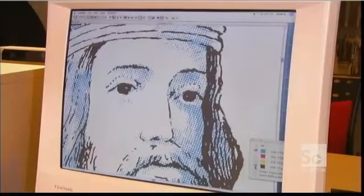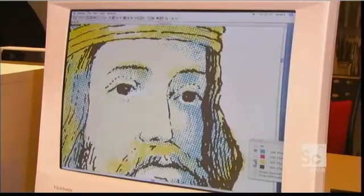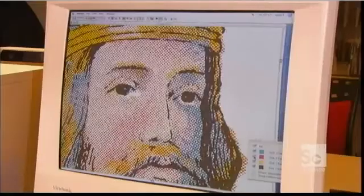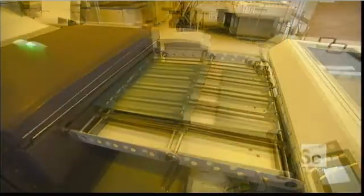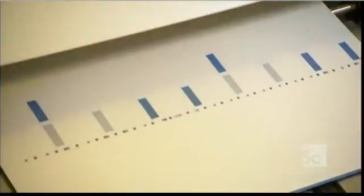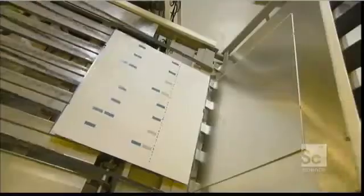Here, graphic artists adapt hand drawings of the face cards, adding color and a touch of regal class wherever needed. The next step is to make the printing plates. A computer-guided laser etches the design into the polymer surface of the printing plate. Entirely automated, this machine produces 30 plates an hour.